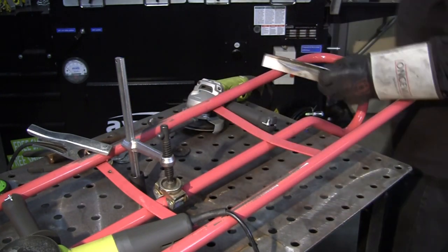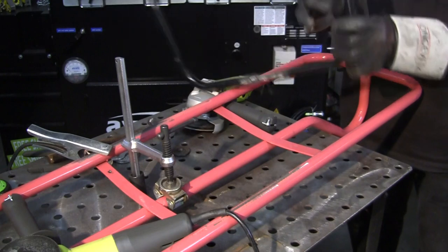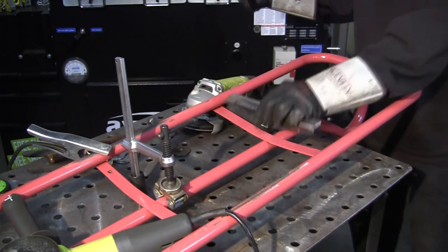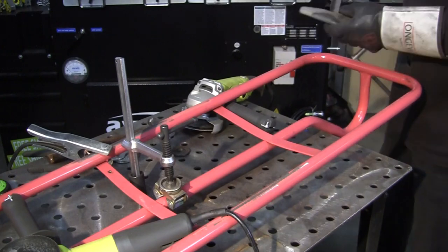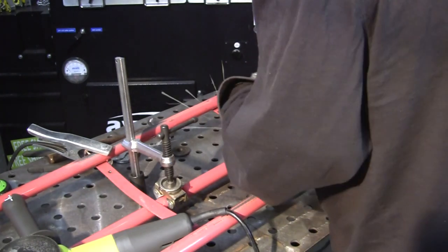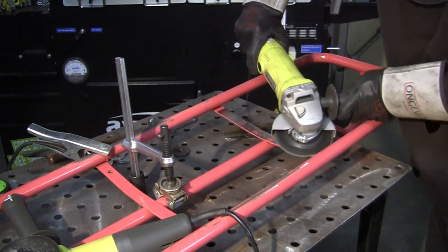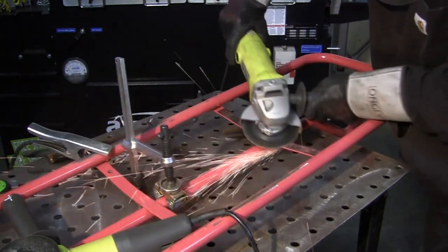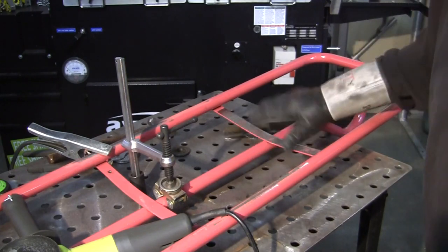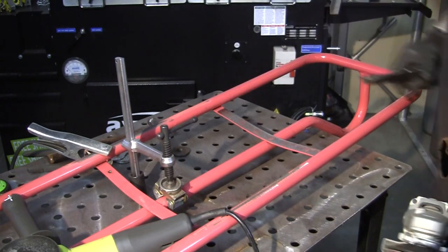What I'm gonna do here is take this paint off and take this bracket with my other piece. This piece here will go up like that and give it some support underneath so it won't twist. I'll fill in the gaps going like that, and take this paint off. You take the paint off because when you go to weld you don't want that stinky smell, and it's easier to strike the arc - that's kind of a common sense thing. That'll go right in there, clean up a little bit more.